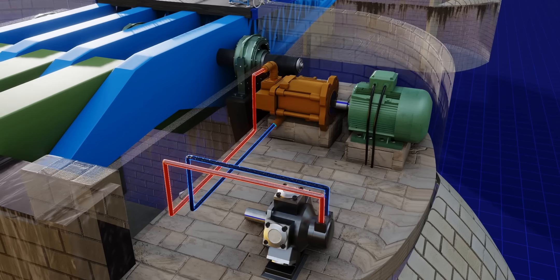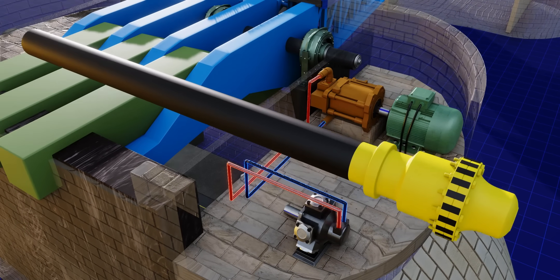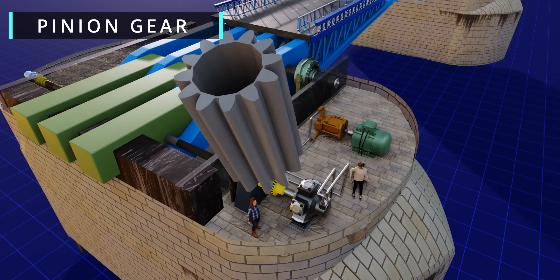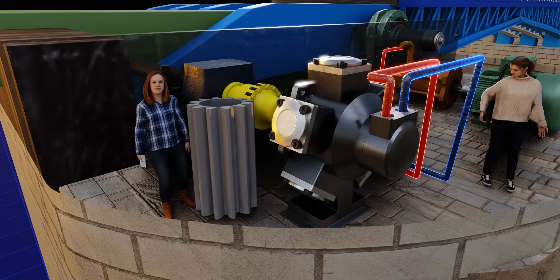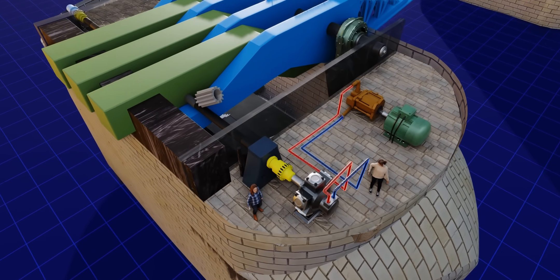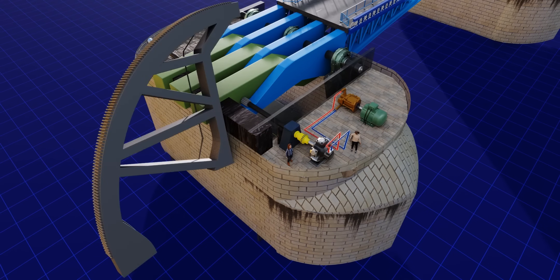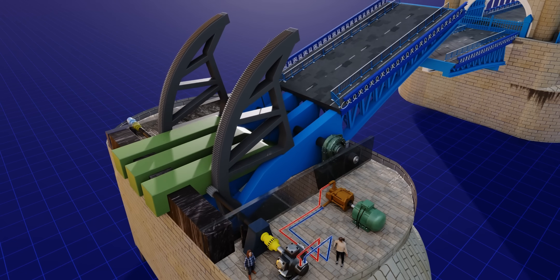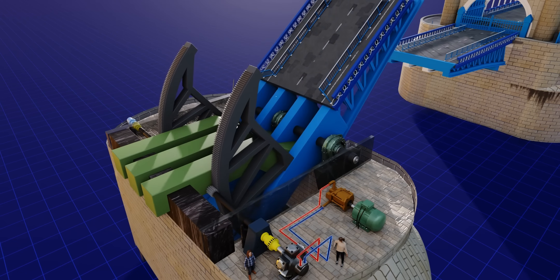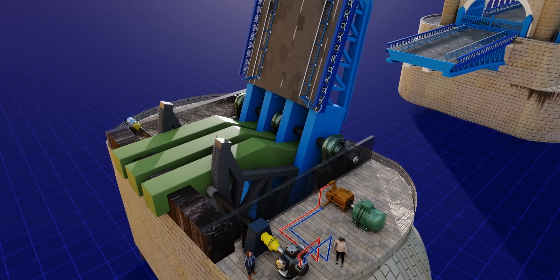The torque multiplication is not over yet. From the hydraulic motor, engineers extended a drive shaft. The pinion gear, which has a diameter of 1 meter, is the next crucial component of the mechanism — the engineers fitted it to the end of the drive shaft. The pinion gear drives a gigantic gear, a rack, which is directly fitted to the bascule. This further reduces speed and increases torque multiplication, allowing the highly amplified torque to rotate the bascule.